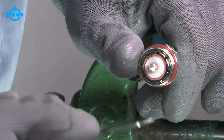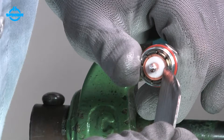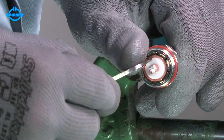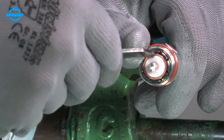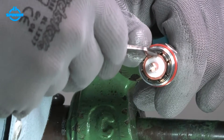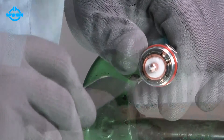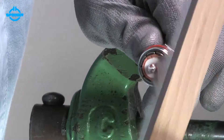Check that the foam is fully separated and evenly spaced from the outer conductor. If necessary, use a knife or screwdriver to remove any remains of foam from the outer conductor to ensure optimal contact. Remove any metal debris with a nylon brush.